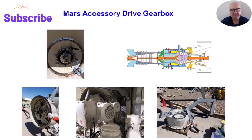Accessory drive gearbox. The gearbox is mounted in front of the gas generator and is driven by a splined coupling that transmits the drive between the two. An o-ring seals between the flanges where the gearbox and air intake mate to prevent any oil leaks. Oil for lubricating the gears and bearings of the gearbox and number one bearing drains to the bottom of the gearbox, where it drains directly back to the tank which is directly underneath.